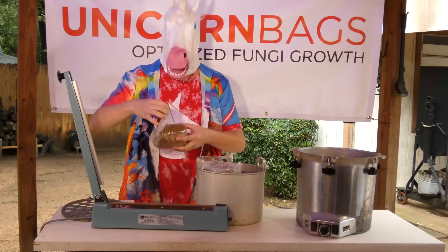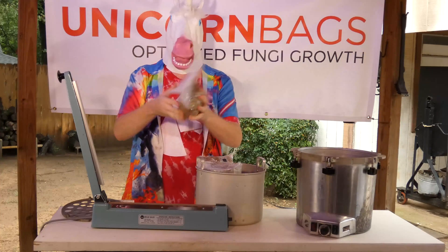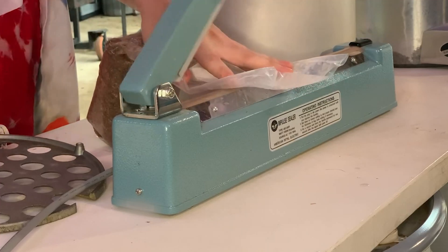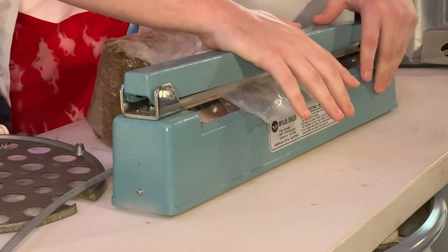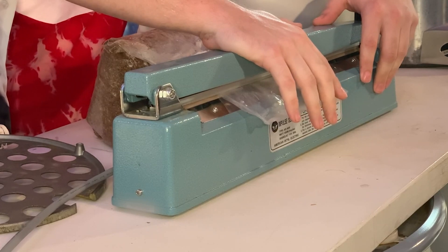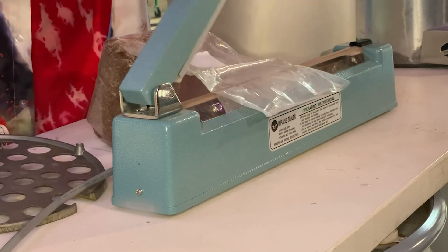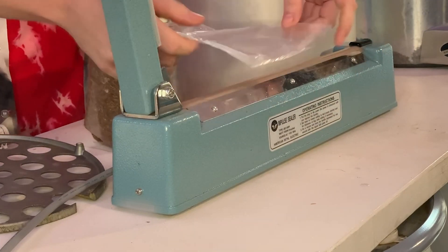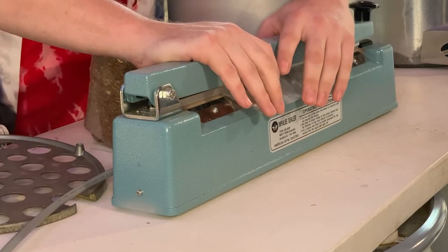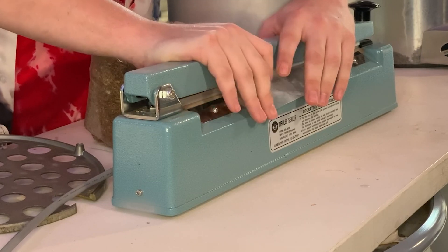Just to show that that wasn't a one-off coincidence, I'm going to do it again. These bags are stress tested at over 200 psi. Random samples are taken multiple times a day, and they must be able to withstand a pneumatic press after being autoclaved, just as if they were being used. You can see how the melted plastic wants to bond to the impulse sealer. Weaker sealers with thinner elements might have trouble getting through water on the outside of the bag — if that's the case, you can simply dry it off to give it a better cycle.